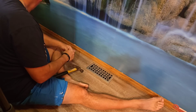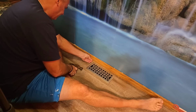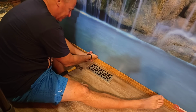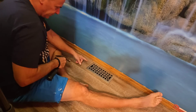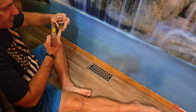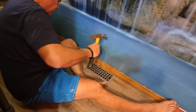So you don't have to put, I mean, I'd say probably 4 to 6 inches apart all the way down. I'm putting them at the bottom. So the head kind of disappears into the crease of the fake wood. And this piece up here will look nice. You won't see it. And these nails are the same color as the trim board. So they are painted and they have them in different colors. So that wasn't by mistake. I tried to get them so they'll blend into the board and you don't see them the best we could. So I'll go ahead and finish.